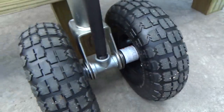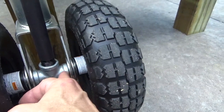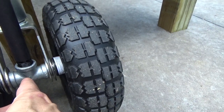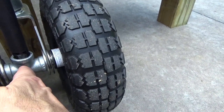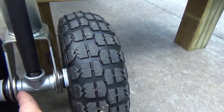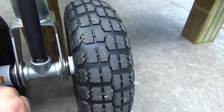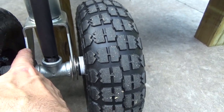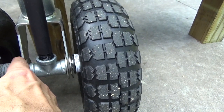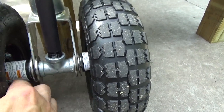Now, in the middle here, remember, there's an existing plastic wheel, so we took it out, and this is a half inch by half galvanized pipe T fitting. In the middle of that T fitting, I put a half-inch long bushing. It's about the length from this spot to this spot, because your wheels are actually 5/8. But this housing for the trailer jack only has half-inch holes, and they're kind of close to the end, so I didn't want to be drilling those out to 5/8. There wouldn't have been a lot of metal left on the frame, so I didn't.